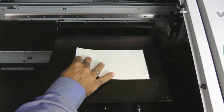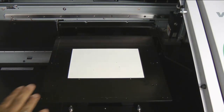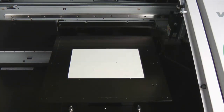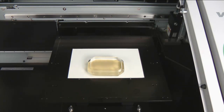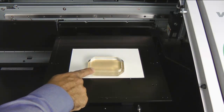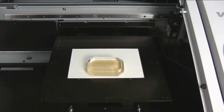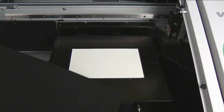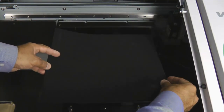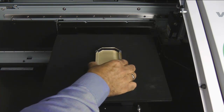To secure your media, you can use tape or the supplied AS10. Now we can take our material and secure it to the table. When dealing with materials that are thicker than 10 millimeters or have an unevenness of 2 millimeters or more, a jig fixture or the supplied sponges should be used. We are going to go ahead and use one of the supplied sponges. The sponge is used to reduce light reflection from the UV lamp as well as reducing misting from the UV inks.